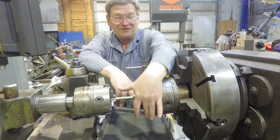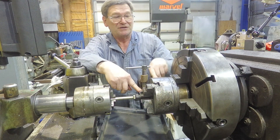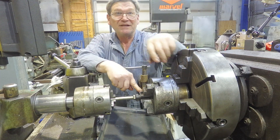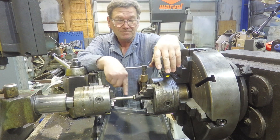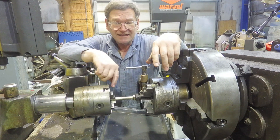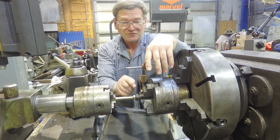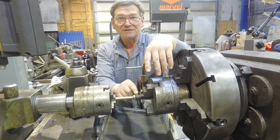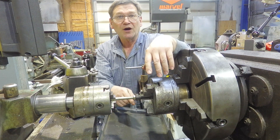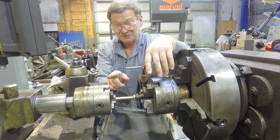The most likely course is that current comes back through the chuck through another jaw to the bolt. It's possible it goes into the chuck and arcs along the screw, but such a small amount it wouldn't really be a problem. In this case where we have two pieces guided in the lathe with only one ground, it makes a big difference where you strike your arc. Strike your arc on this piece first, then work it over to the other one — once they're joined there's really not a problem.